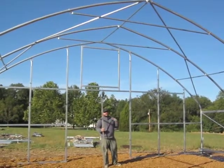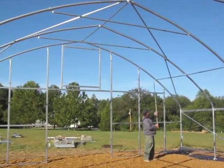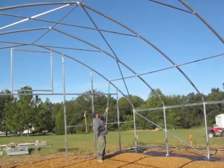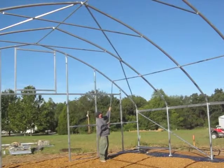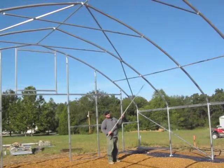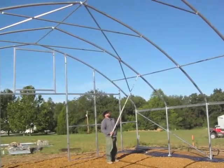Additionally, there are also purlins. A stationary building and a pipe skid building both have three purlins. Right here we have a roof purlin. When we installed our hoops, we measured up from the hoop seam about 76 inches to make sure that our roof purlins were in the same location. We marked every hoop on the ground so when we put up our roof purlin, it would always be in the same spot. It's attached to the end with a one-foot purlin end — it's got a flattened end and two brace bands, which makes a strong joint between the purlin and the end wall hoop. Aside from the first hoop and every middle hoop, it's attached with a 2x3/8 by 1x3/8 cross connector. We make sure that all the nuts are facing down — we don't want to hang anything from these. This is a structural piece of hardware, not something to hang things from.